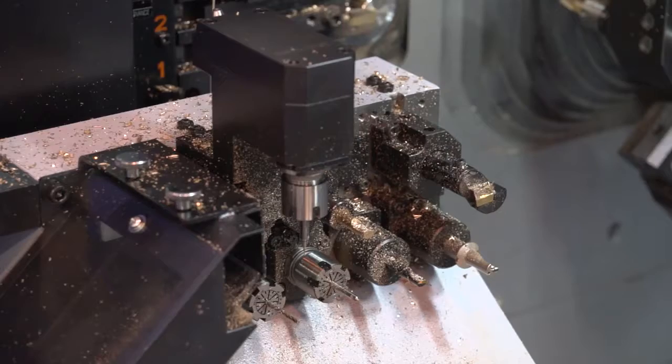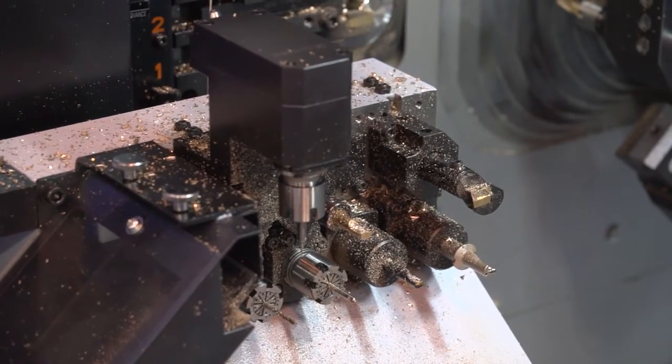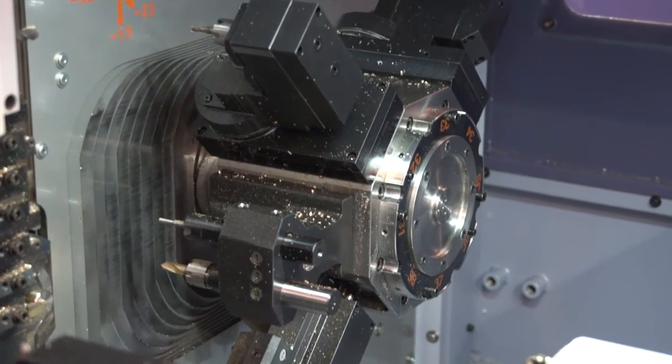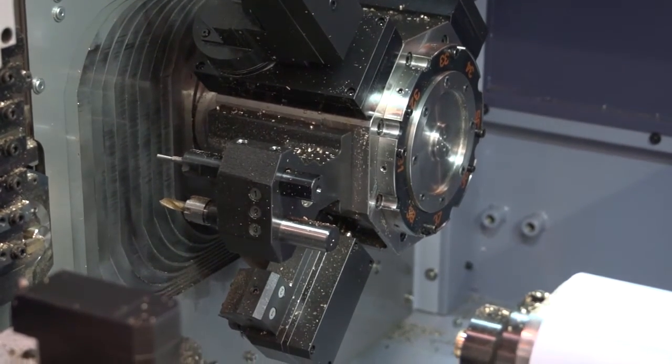The features we've got: we've got a platen that has five cross-working tools and seven turning tools, so that gives you the high speed that you're used to with traditional sliders. And then we've got an eight-station turret that gives you that flexibility — or configurability, if you like — for more complex workpieces.